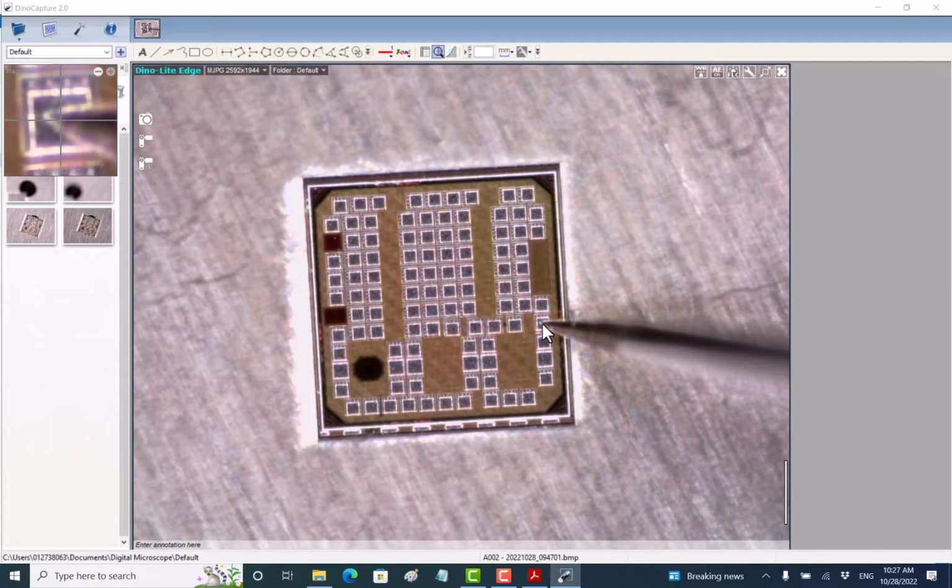Once it's live, it means it's touching. If you want to make sure that it has a good contact, you can pull it back. Just think about it. Go down, it's live. Then you pull back and go down again, slide more. But you don't want to do too much. You may break the tip. Now, let me slide back and you should see a scratch. And then I usually do a little bit more. And then I'm sure it has a pretty good contact for this one.